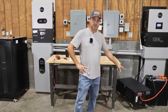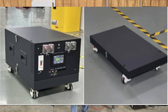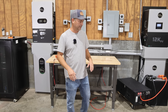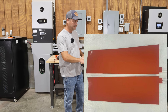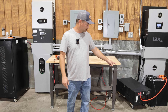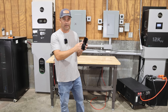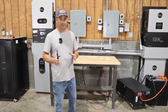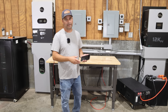There are a couple of accessories available for this battery. One is a rolling dolly the same size as the battery — you can stack three or four batteries on it and move them around. The other accessory is heating pads, which sit at the bottom under the cells. You wire the heating pads to the BMS, and in that on/off settings screen you can activate them. If you're installing the battery somewhere that might drop below freezing, you'd want those heaters.